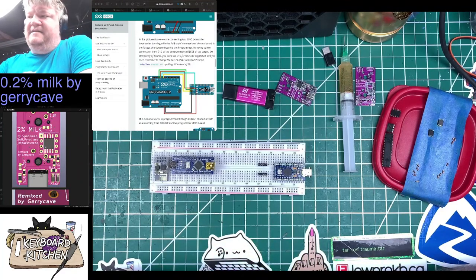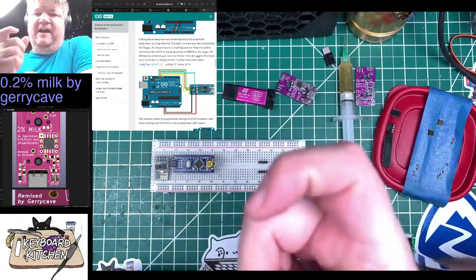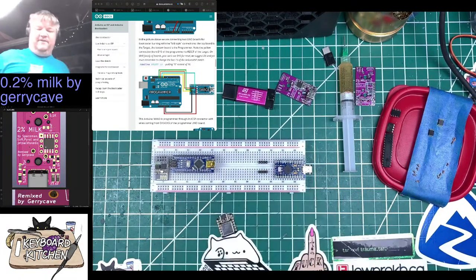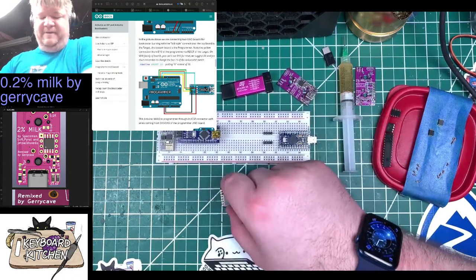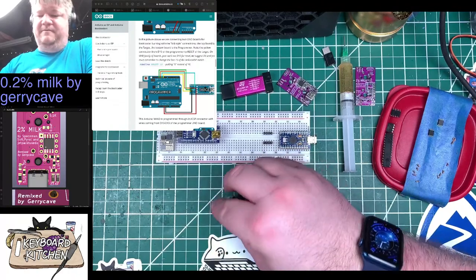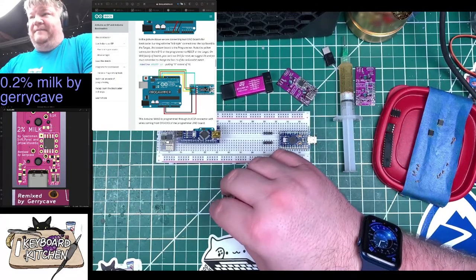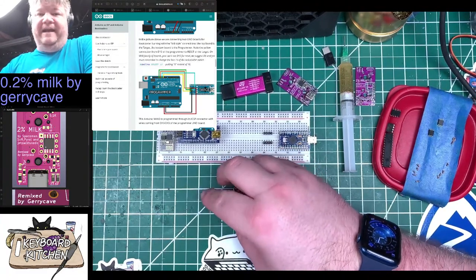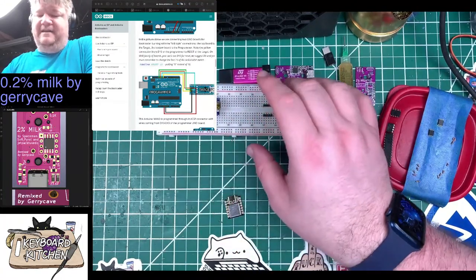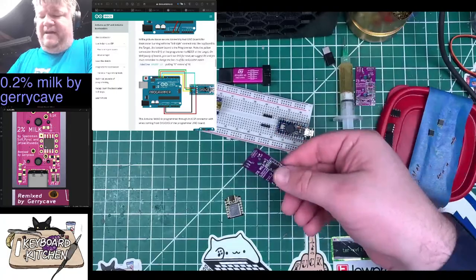It also has an onboard I/O expander, but it uses a Xiao footprint. So, one of these for a controller. The idea is to make it more accessible to people who either don't have PCBA, or they can take the PCB and get a run of them made and then build it. You don't need as much high skilled surface mount soldering stuff, because you don't need to solder all the stuff for an embedded controller.